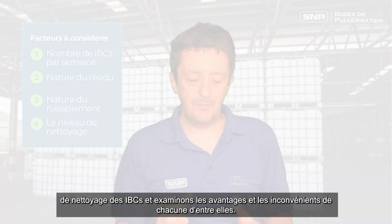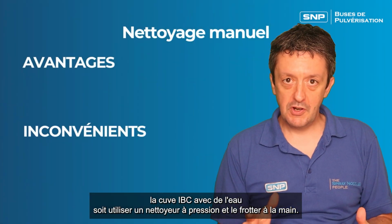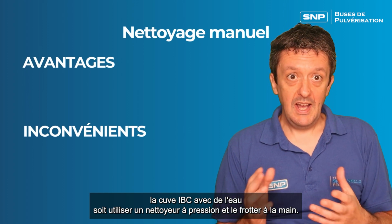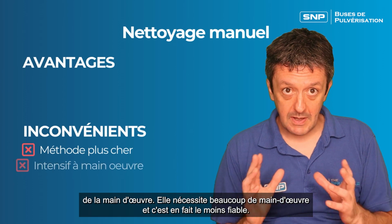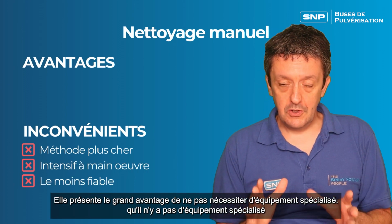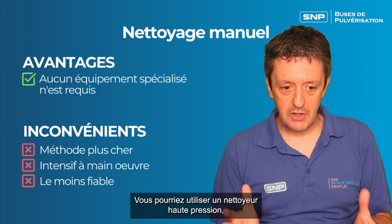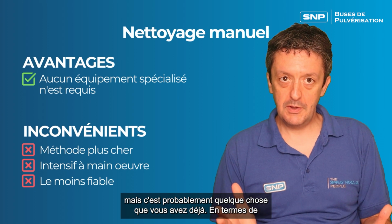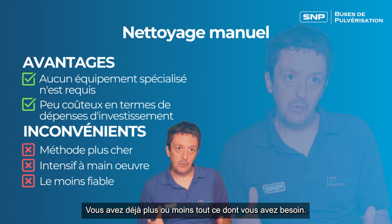for each of them. First, we have manual cleaning. You can either fill the IBC up with water or use a pressure washer and scrub it by hand. Now this is probably the most expensive when you factor in all of the costs there. It's labour intensive and it's actually the least reliable. It has the big advantage that no specialist equipment is needed in particular. I mean, you might use a pressure washer for it, but that's probably something you're going to have already. In terms of capex costs, it's very cheap. You've got everything you need already, more or less.